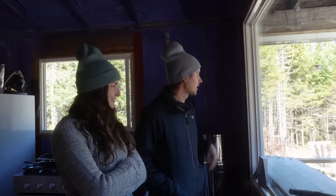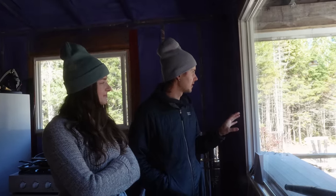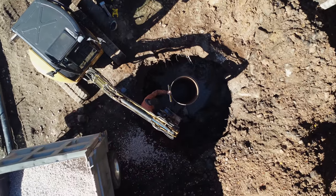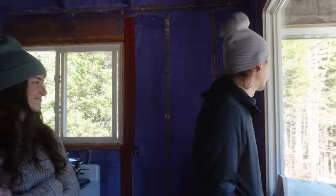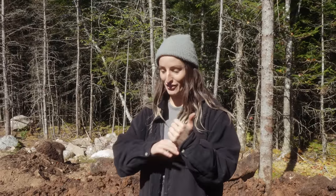So he's being extra careful right now to make sure he doesn't move the tube. And then that steel tube goes in it when the cement comes. They can do hard things. Us, we just watch. So you need between 8 to 10 feet in the ground, and Porter hit 9. That's with gravel and everything, and then backfilling, so I'd say that's pretty perfect.